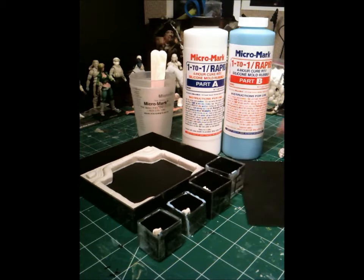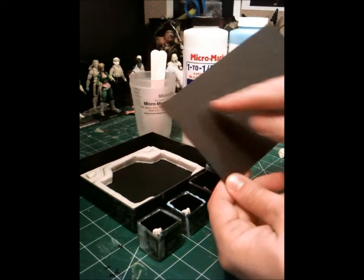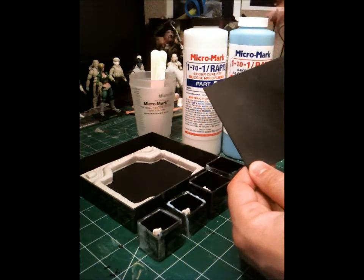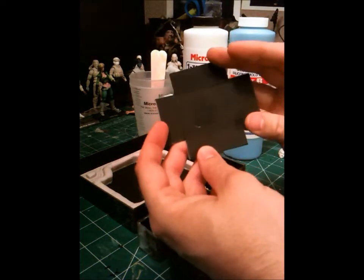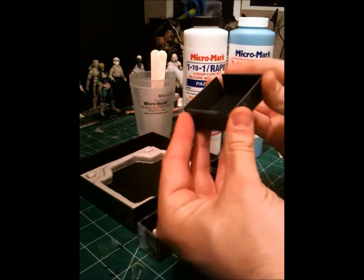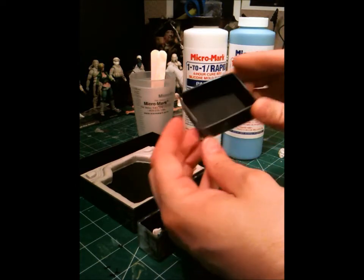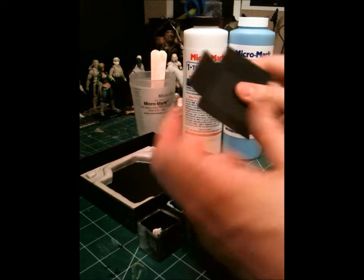It's very good for building mold boxes, and I'll literally just measure out a box, and I'll score the edges, the parts that will fold up. For example, this piece right here. Here you go, there's a flat piece of mat board I just cut out and I scored, and you can bring it together and just tape it, and you've got yourself a custom mold box of a certain size and depth that you can use over and over again if you take good care of them. And I've got all kinds of sizes.